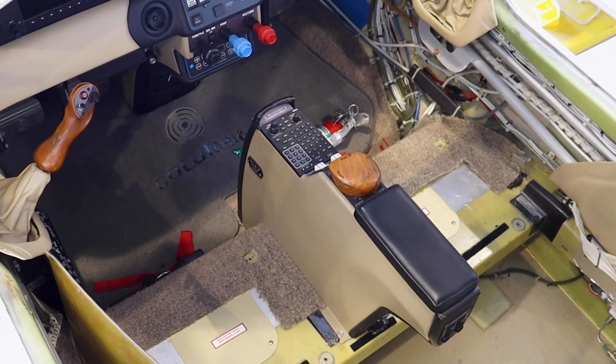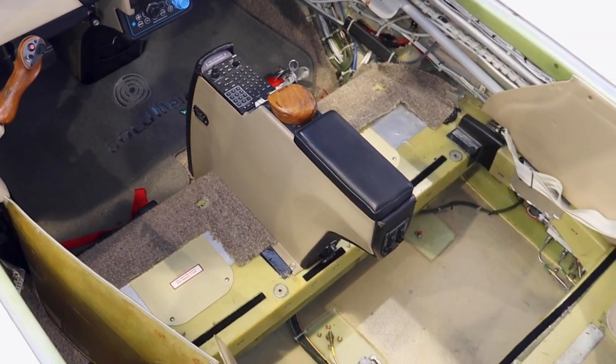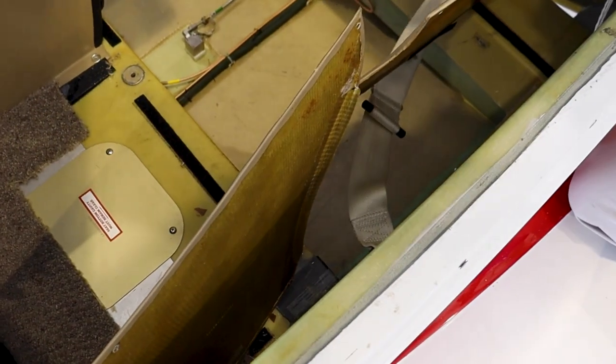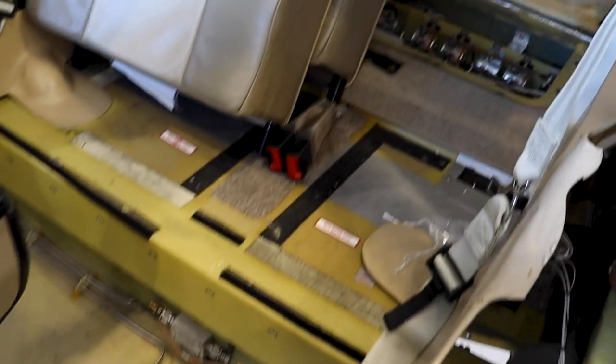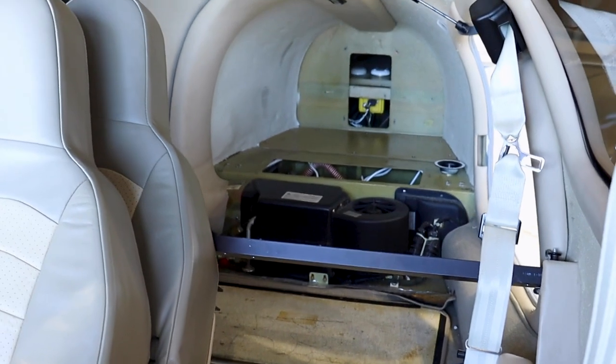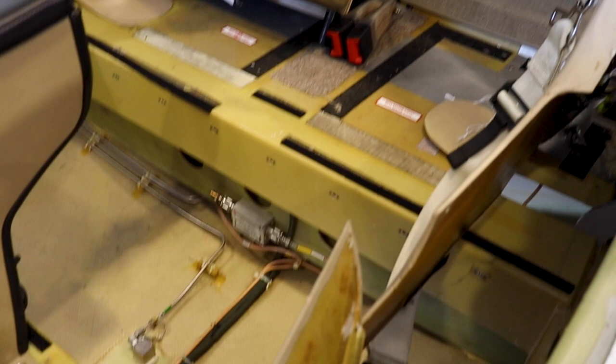Down the sidewall of these airplanes there are actually 30 wing attach bolts, and a lot of people don't know it, but this whole wing is one assembly that drops straight off of the aircraft. The torque on those bolts is crucial. They're all 7/16ths — pretty small bolts, but they're sturdy.